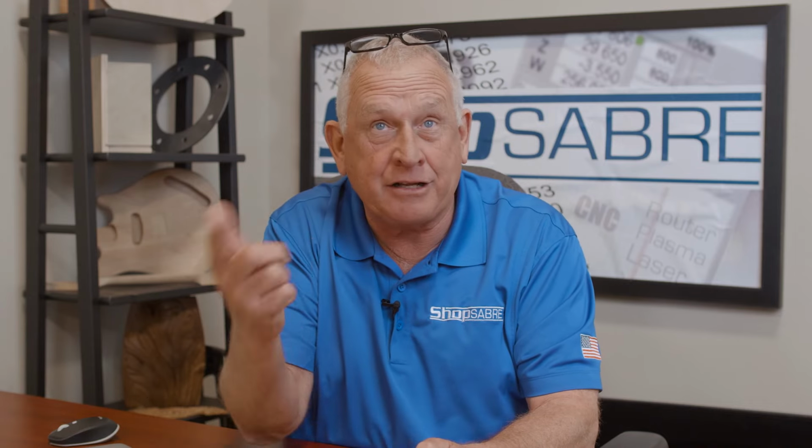Now, here's the thing you run into when you're gluing. You've got to be really careful and get it level, because if you're off a 16th, it takes a 16th to flatten that out and the same amount on the other side, so it's real easy to run undersized. So you've got to be really careful.